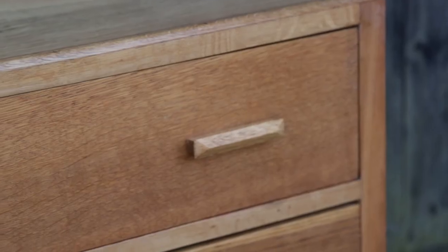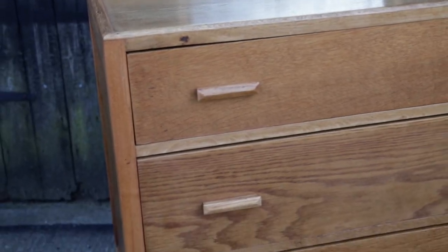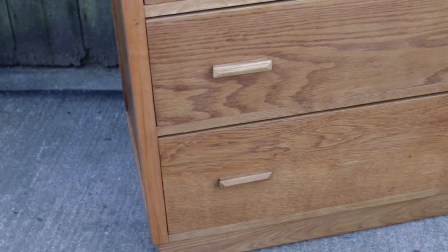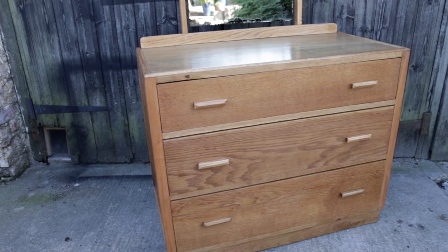And that's just cleaning up, sealing with some hard wax and some thinners, and then just giving it a coat of polishing wax. That's come out not too bad at all. So we'll probably use that ourselves. Swap that out for what we've already got. Drawers are all solid now. Yes, it shows signs of age, but that's what's quite cool about it. Job done.